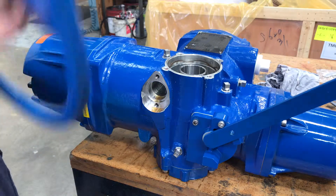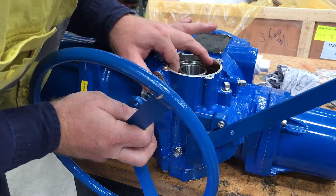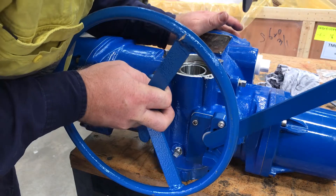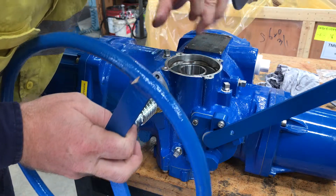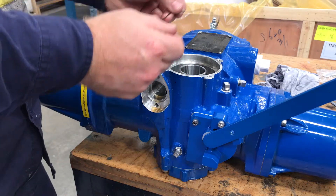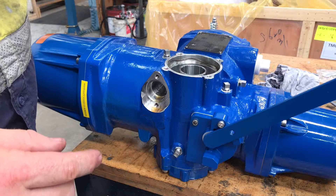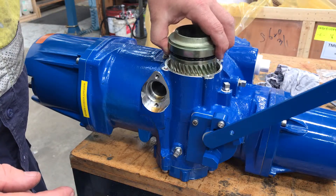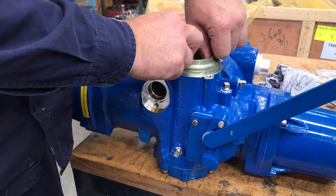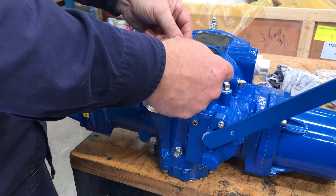If needed, just use the side mount hand wheel to square it up — a good little trick. Use the side mount hand wheel to push that bearing in the back first. Make sure the wave washer has the little prong sticking up. Then reinsert the side hand wheel adapter, twist it and it should push down a bit further, then insert the retaining ring.